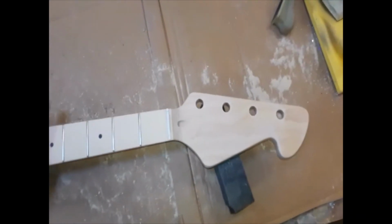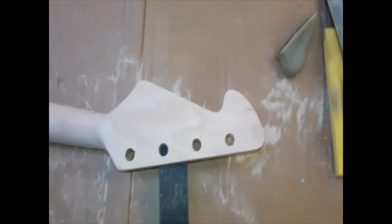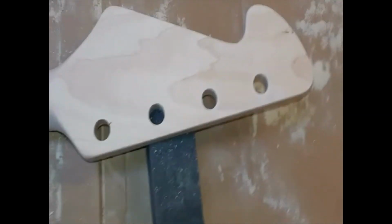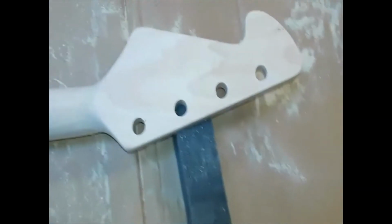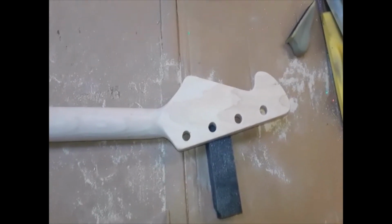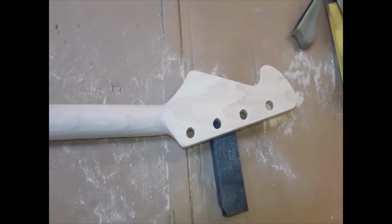As soon as that gets done, I'm also noticing there's some really good grain. See, the picture of just the grain looks really cool going on there. And if you look at this other thing, that's the one with the teak oil I put on there. I think that's going to look really good on there. So that's still the plan. I'm going to go back and do a little more fine sanding on this thing, get it up to 800, and throw some oil on there.